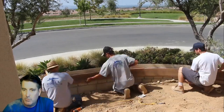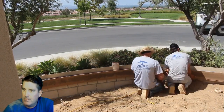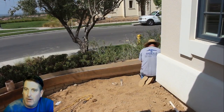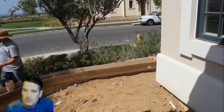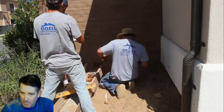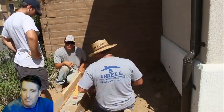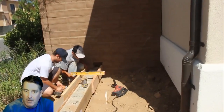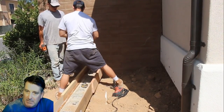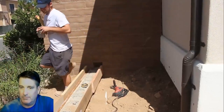I'm making a four-inch raised cap here — a pretty hefty one. I'm going to lay two runs of number-three rebar all the way around. The block is level and the level I'm using is not completely necessary here, I'm just verifying it even though I'm going four inches up on both sides. It's kind of fun to check it with the level from time to time.